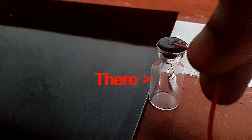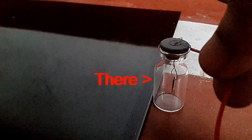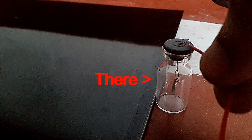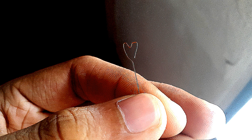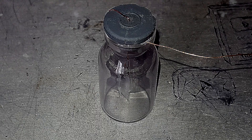I tried to charge it, but this model has a little flaw — you might have already noticed it. Sometimes the two foils come too close and stick to each other, which will restrict their free movement. As a remedy for this, I came up with a modification by bending the copper ring into a heart-like shape. Both of the foils rest in individual curves, and it works flawlessly.